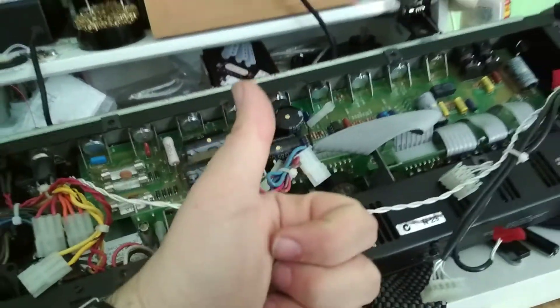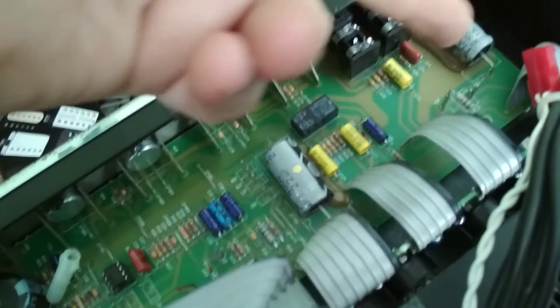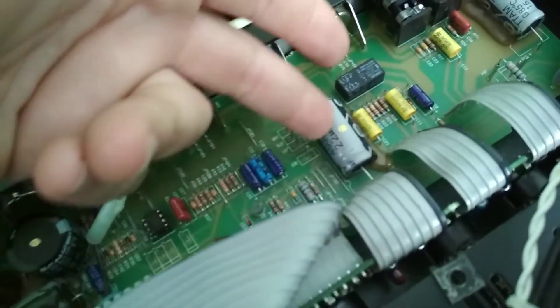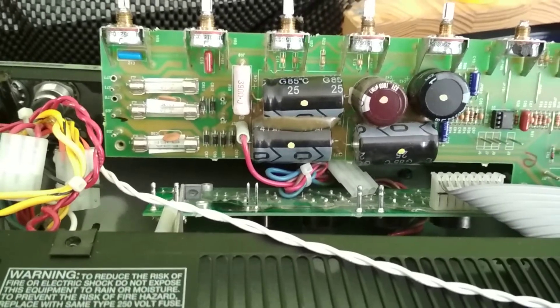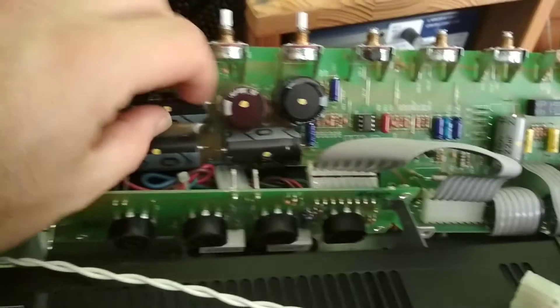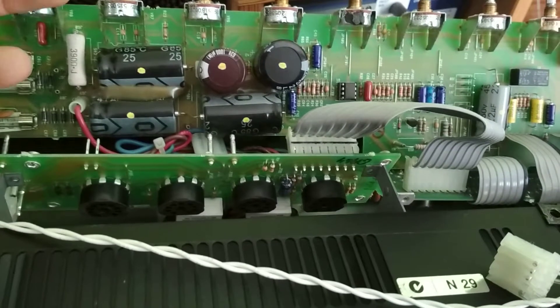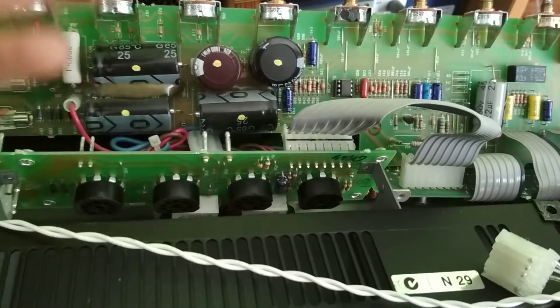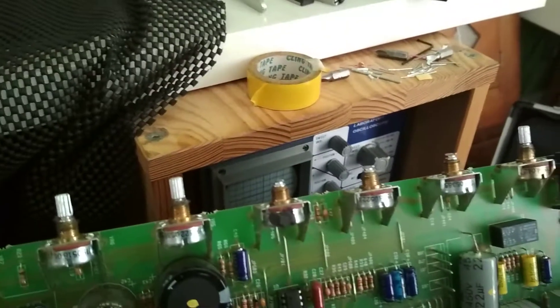That's another reason why I don't buy their stuff anymore. And if you're watching PV, subscribe to the videos so I can show you what good amps look like. I've also got a couple of filter caps over here that I'm going to change for good measure — there's probably nothing wrong with them but they're worth about two bucks each. The struggle is real. So I finally got the board out. Next step: I've discharged these so they're safe to touch. Desolder them, rip them out, put new ones in, test things, re-bias the amp if I have to. If you can't tell, I love this amplifier.